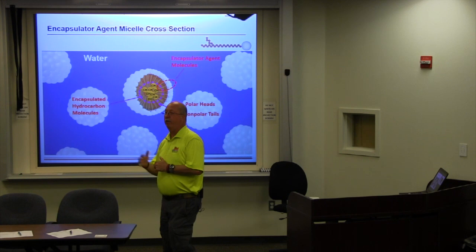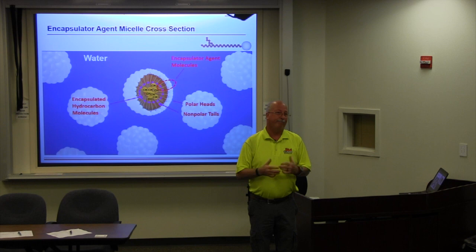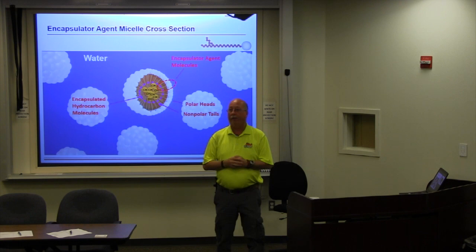With F-500 being used at a 3% concentration on these types of roadway incidents or spills, you can wash it down, get your LEL meter out, and test it. Your LEL meter reads zero. Let it evaporate away. You're good. Okay? It's done. It will not reignite, no matter how long it sits.